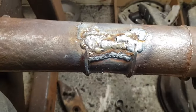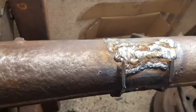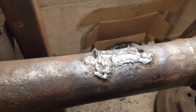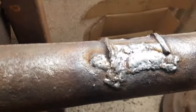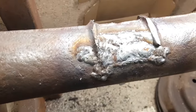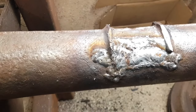Just done a fair amount of weld on this first section of the rear axle. Made sure to warm it up first and temper the steel, then concentrated on just building up the hole that was made, building up and flowing the metal all the way around onto the higher bits of the low sections.